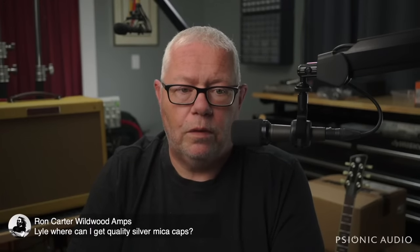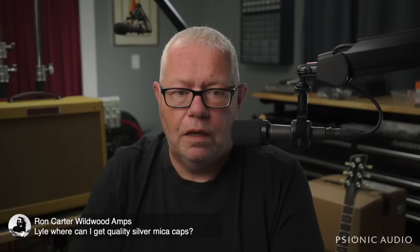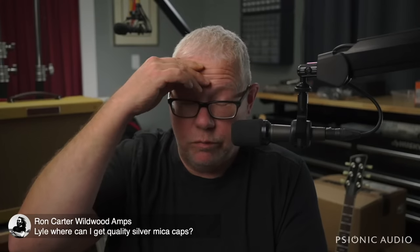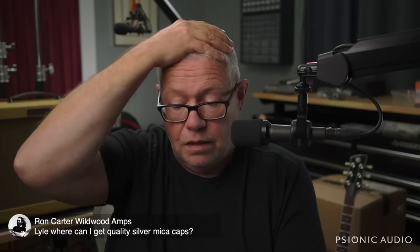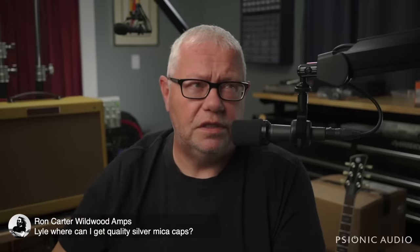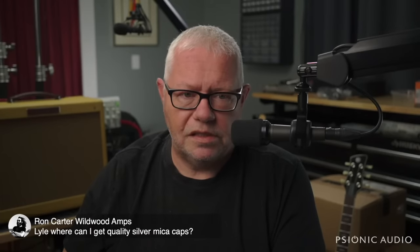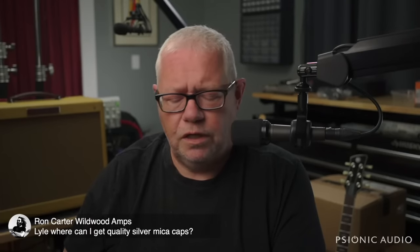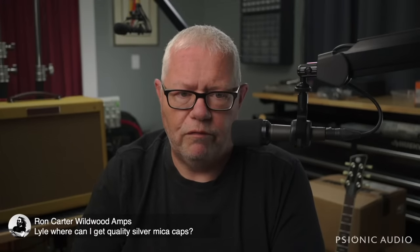Ron Carter, Wildwood Amps. Where can you get quality silver mica caps? You can get them from Mouser. You can get them from DigiKey. You can get them from C Distribution. You want the ones that say CDM, or CDE, Cornell Dublier. You do not want the ones that say SM alone. And you can get the ones that say Sozo if you want. They're fine. You pay an awful lot for them.